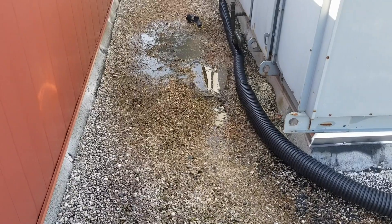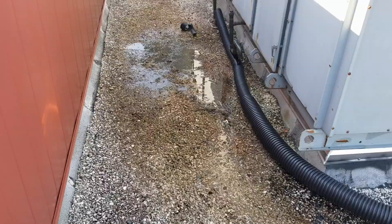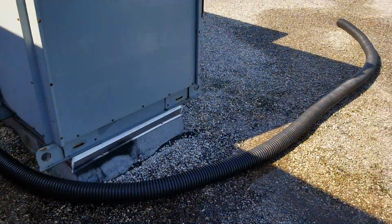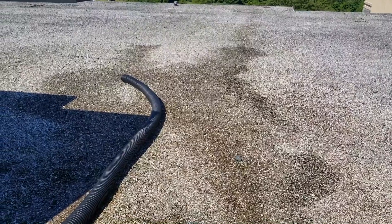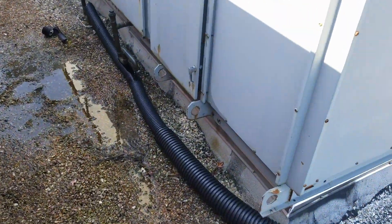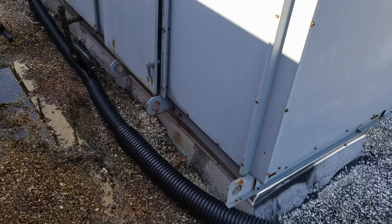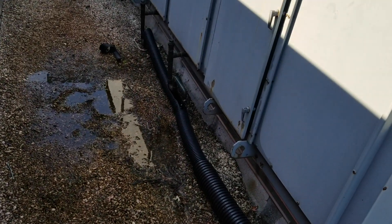I don't like water laying on the roof anyway, but this traps water between it and the peak of the roof. Even if it was working right, the water just runs all the way down to the end of the roof, which is less than ideal. So I put this pipe on to try to route water away from the unit so I can investigate the base flashing — it's just better for the roof not to have ponding water there.